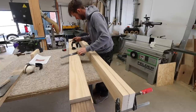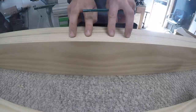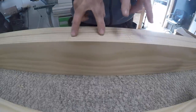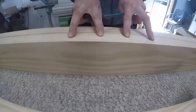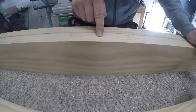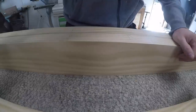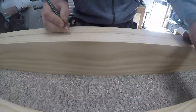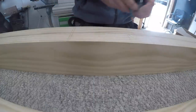And then the middle rail, which is the same principle, but instead of, like the bottom rail, having offset tenons, we're going to have a mortise and tenon either side of the joint. So it's going to be two tenons and a haunch in the middle. So it's separated up slightly differently from the bottom joint. So we've got that 5mm setback for the bevel on the rail there.